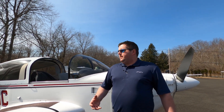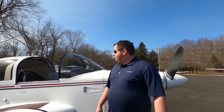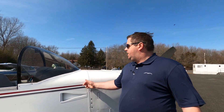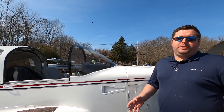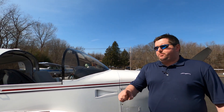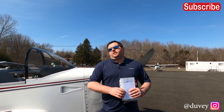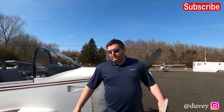Then they made another variation before the Tiger, and then they actually made the Tiger. It's not a common airplane, but a lot of owners consider it their first choice because it's reasonably economical to own. It's got a fuel burn of about 9 to 11 gallons an hour depending on your power settings, and a max gross weight of around 2,400 pounds, so it could fit three pilots of my size on a cool day near full tanks with a bag or two.